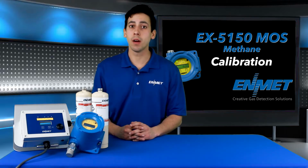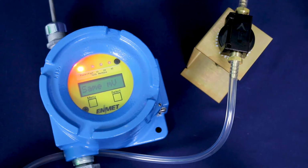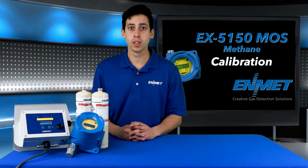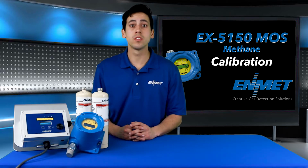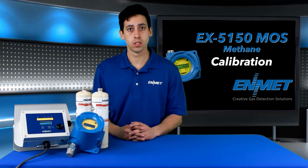If the sensor did not respond to the calibration gas, Same MV will be displayed. If the sensor responds, but the signal is not within acceptable range, Bad Span will be displayed. If the sensor is responding, but the signal is not stable after 5 minutes, Unstable will be displayed. Consult ENMET technical support for troubleshooting assistance.